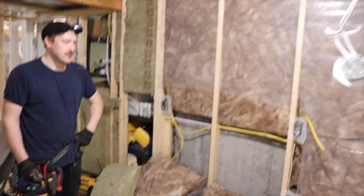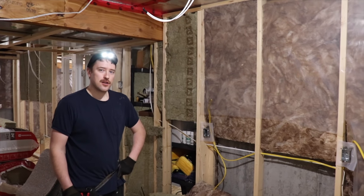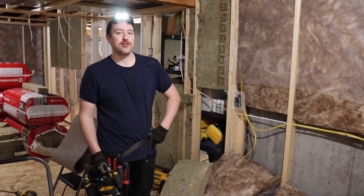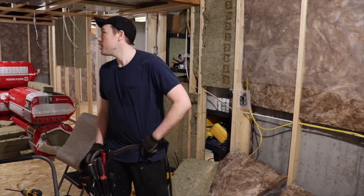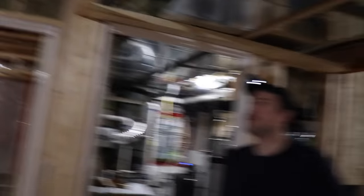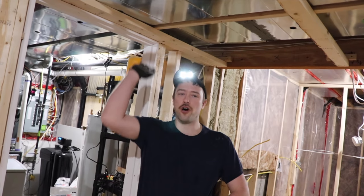What are we doing with the ceiling for the lights? We're doing slim LED pot lights — four-inch. They're kind of the newer style over the last five years. You don't use the old cans anymore because those take up a lot of space and protrude into the ceiling. With these small ones, you just drop the wire down, and when it's time to finish, cut the hole out with a hole saw and install everything through that hole with spring clips.